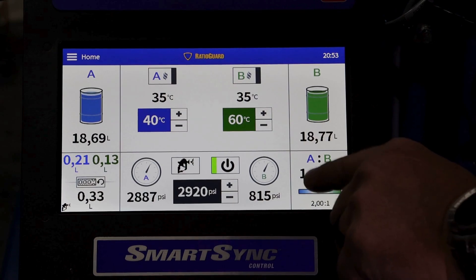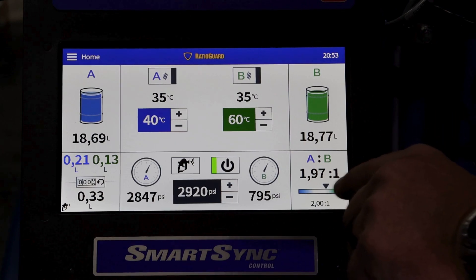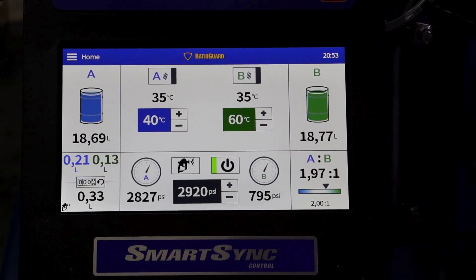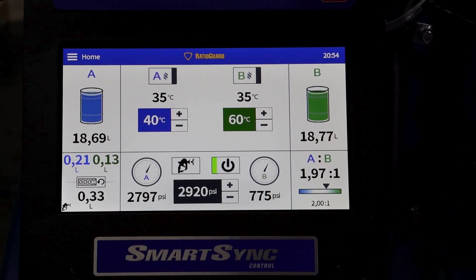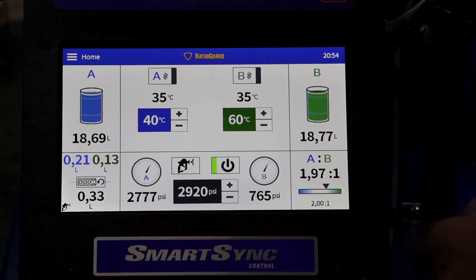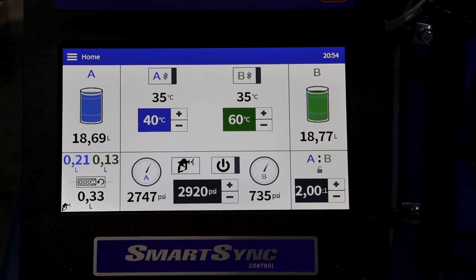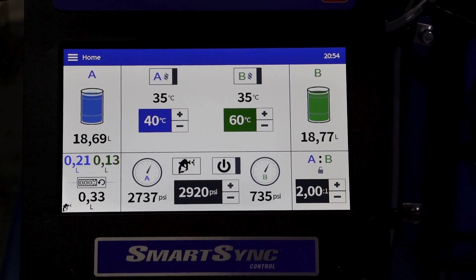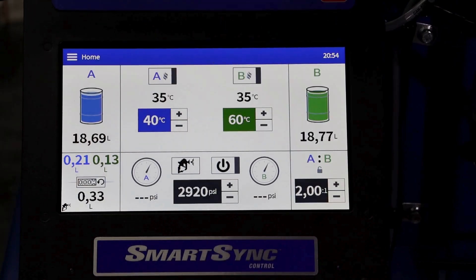On the right hand side, you will see our actual ratio versus our set ratio, and we'll see where our pressure balance is sitting. While spraying through the spray tip with material at the right temperature, we'll be able to adjust the restrictor to get that balance spot on. When we're ready to stop spraying, we can turn the machine off, close the manual valves, set the valve back to the recirculation position, dump all pressures in the unit, and switch off A and B heater.